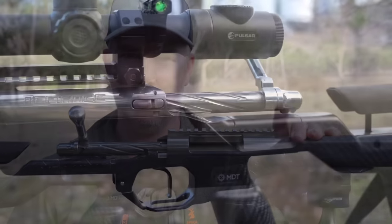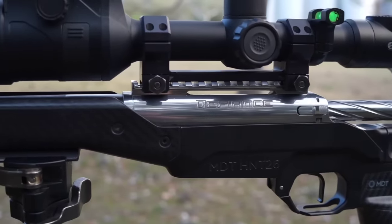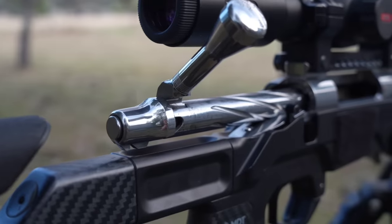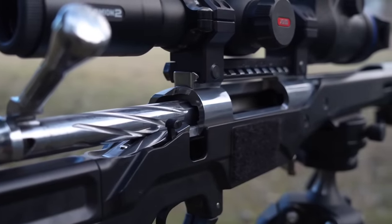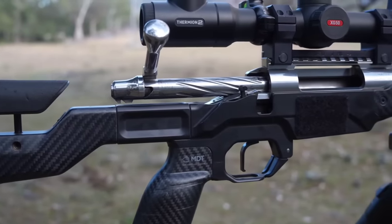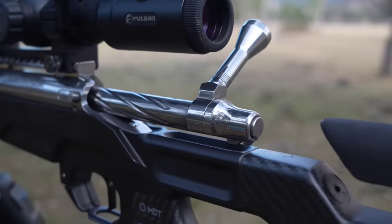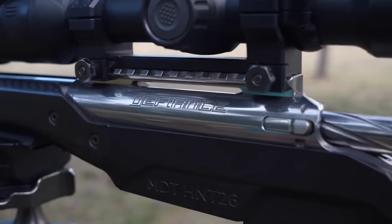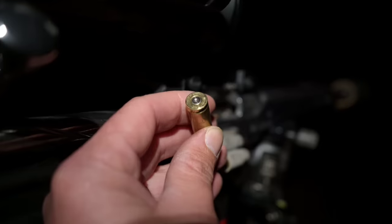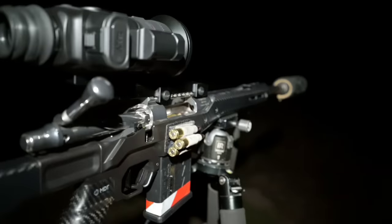The action is a Defiance Tenacity with a 20 MOA Picatinny rail. Basically, it's a Remington 700 clone with a bunch of upgraded features. The bolt is a 90-degree lift with spiral fluting, although not too deeply. Overall, the action and bolt are just uncoated stainless steel as it came. I might get this coated at some stage with something like Cerakote, but we shall see. I purchased this from Huntsman Oz, who is our distributor for Defiance Machine in Australia. There was a time shortly after getting it that Defiance Machine stopped sending actions to Australia, but I do believe they are shipping again now. It's working really well, so long as I don't use any PPU brass, as it won't extract that properly — I think it must have a thicker base that the extractor won't grab. Anything else brass or ammo-wise functions flawlessly.